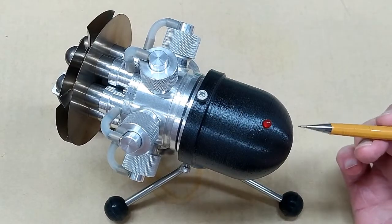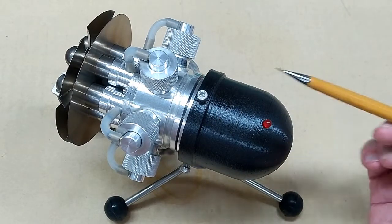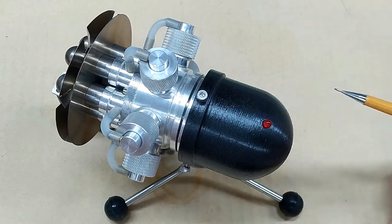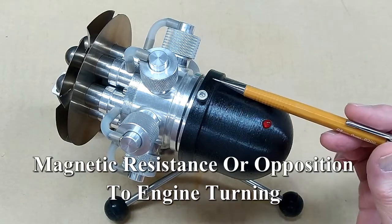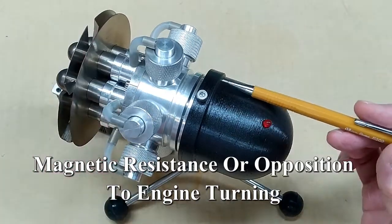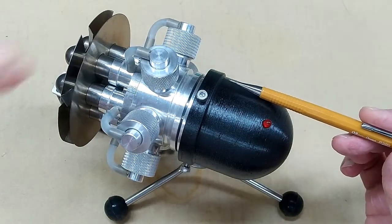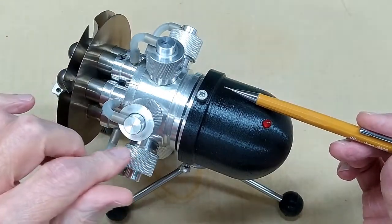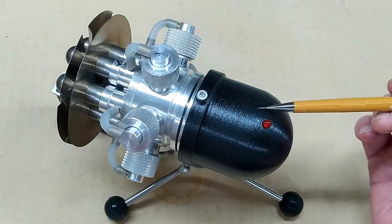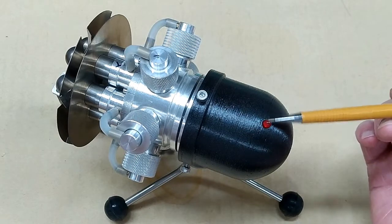Just a little bit about how this is working: when the iron bars in the coils are pretty close to the magnets, this will generate 2 volts or better, but there's so much resistance that this cannot get up to speed. When I back those iron rods away from the magnets, this can run easier, but the pulse generated by the magnets is weaker. That's when the Joule Thief boosts the voltage up to where it will light this LED.